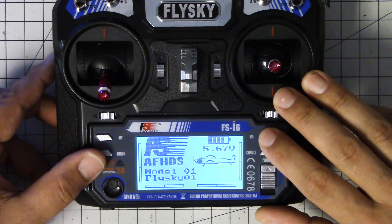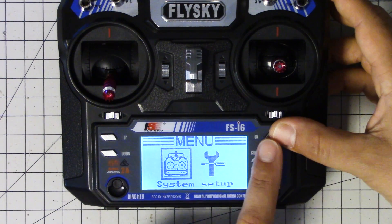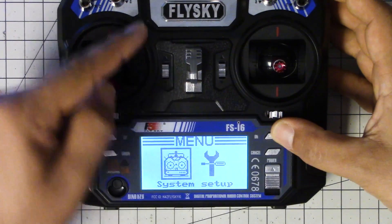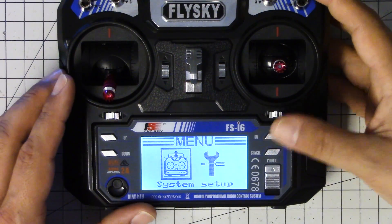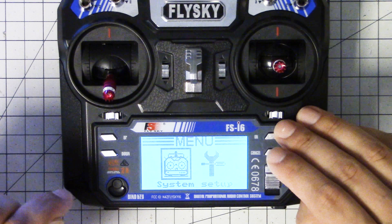To get into the system menu on this radio, hold down the OK key. If you got a ready-to-fly copter like an Eachine Wizard, they may have locked out that ability. There's a secret keystroke you can use when you power up the radio to unlock it. Joshua from the future here: it is the Eachine i6 transmitter, which is exactly the same as the FlySky FSi6 — just the Eachine version that comes with ready-to-fly copters like the Wizard. To unlock the menu, with the unit powered down, hold the two bottom trim switches inward, then power the unit on while holding them. They lock you out because they figure if you bought a ready-to-fly quad you may not know what you're doing.